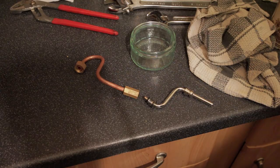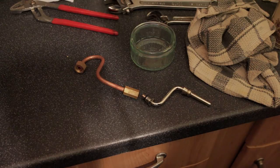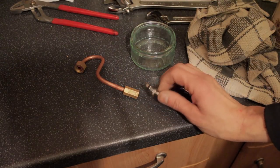Once the soak is done, I'm going to have to reface the actual mating surface for the gasket. Thankfully it's all flat, so that'll be easy to do with some fine wet-and-dry sandpaper on a glass sheet to keep it dead flat. I'm going to sand that on the glass sheet to get a nice dead-flat mating surface so I know it will go back together and seal properly.